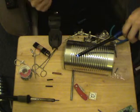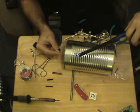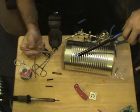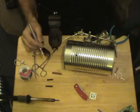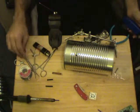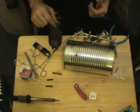And I gently fed in some solder. Just like that. And, I mean, it takes a bit of practice, and it's really hard for me to do this on camera. But, point being is, you get the area hot with a butane. This is a campfire lighter. You could use a soldering gun or even a low power butane pen torch, whatever you got laying around. A 35 watt soldering iron, chances being it's not really going to work too well for this application.